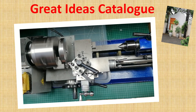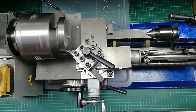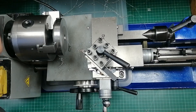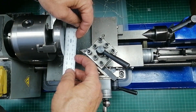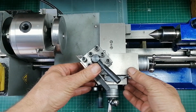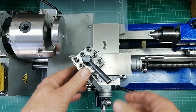Here's the thing. Every time I try to face a part on my mini lathe, the saddle just wanders off on its own. Instead of getting a nice flat face, I end up with a bulge. And the crazy part — none of the bigger lathes I've used ever did this. To make it worse, this little machine doesn't even come with a saddle lock. So I had to build one myself.